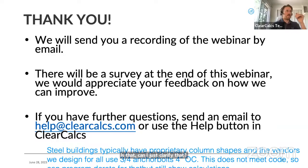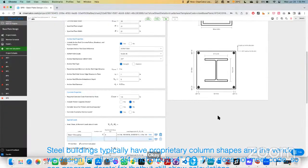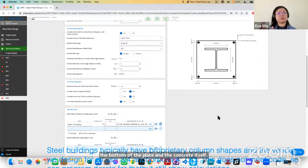Nathan, feel free here. I'll look you up in this chat and see if I could just unmute you, so we can make sure to have your question answered. Just prying, like from overturning, prying between the bottom of the plate and the concrete itself. We will check if there's overturning of the plate column assembly from any forces, that the anchors are adequate.